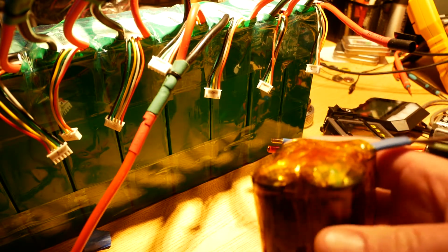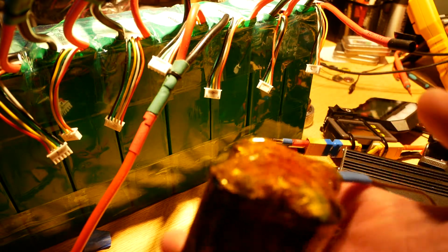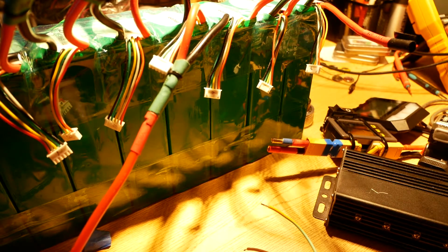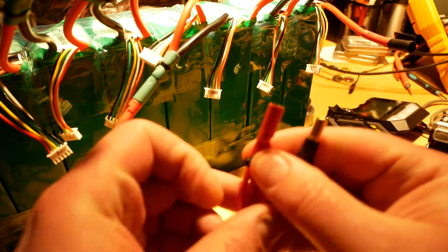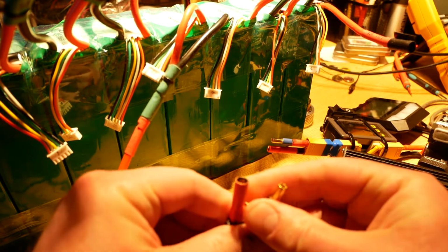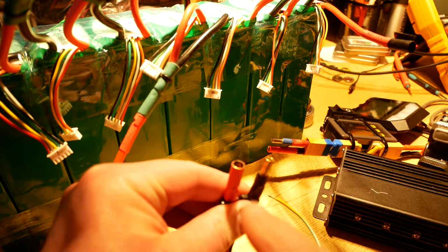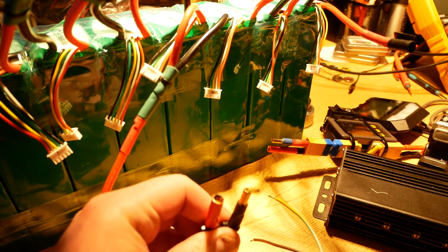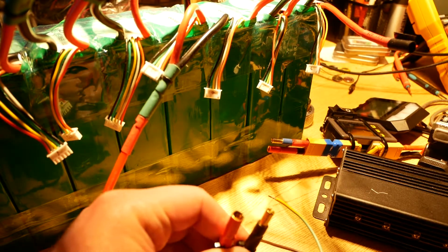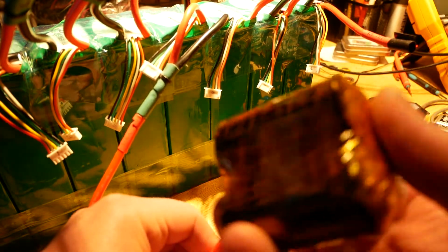You get a big spark when you plug the battery pack into the controller, and this is bad. And I'm going to show that spark. It is also an 82 volt wheel, so I've got these two wires hooked up to 82 volts. You probably can't see it so well on the camera, but this female bullet right here, these are 5.5 millimeter bullets. They're good for, I guess, about 150 amps. The inside of this one is really scorched because I've done this a few times now, just playing around with the capacitors.